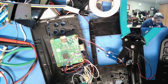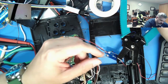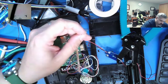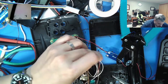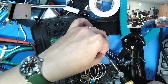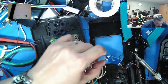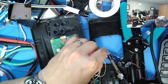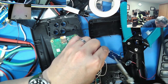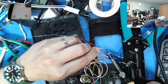You work with solder, it's called tinning it. And the funny thing is, it really is tin. It's not a euphemism, it's actually tin you're using. Well, and lead in this case. Though, in the big scheme of things, lead is slowly phasing out, except for crucial applications. The problem is when they went to lead free solder, you get what's known as tin whiskers, which aren't good, or dendritic growth, which can be very dangerous.